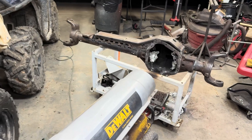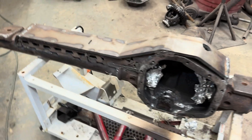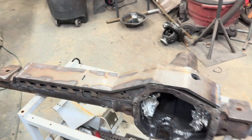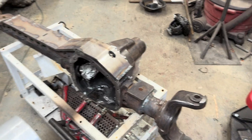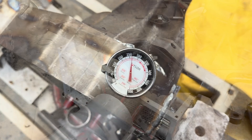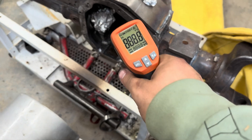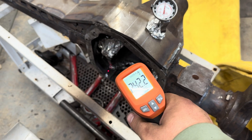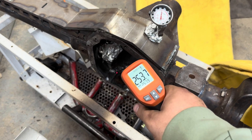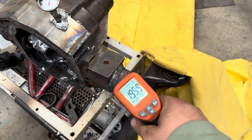This is now our last and final heating. I went and welded the axle tubes on both sides. Now I'm going to wrap it, see if I can stick the thermometer in. We're at 275 on the gauge, and where we were welding is about 250-260. Out here it's about 200 — not as hot as we wanted, but whatever. Maybe we'll consider that part of the cooling.